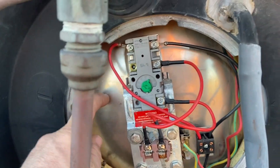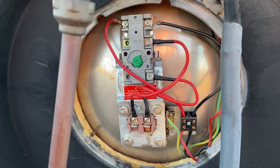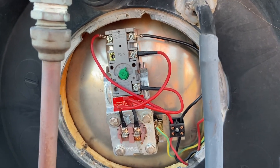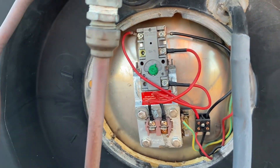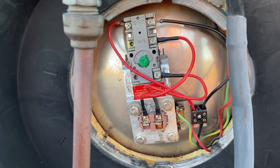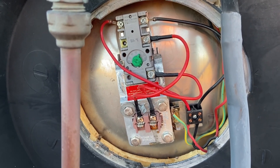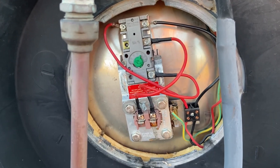This is a stainless steel tank so it won't have an anode. You can actually get stainless steel elements, although no one ever stocks them. But you do have to make sure you get a good quality element, otherwise if you get a cheap one from wherever it'll probably only last a few days or weeks. So let's get this thing disconnected — we have to make sure we turn the water off of course — and then we'll pull it out and put the new one in.